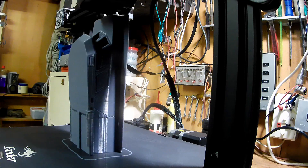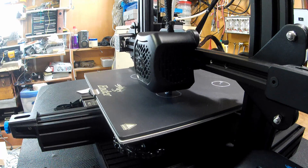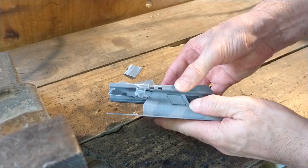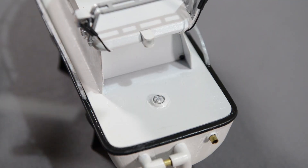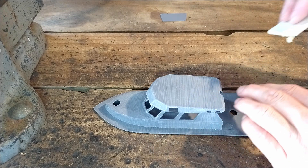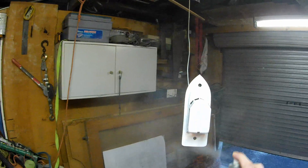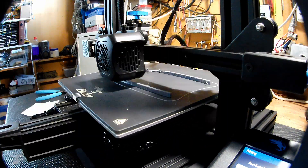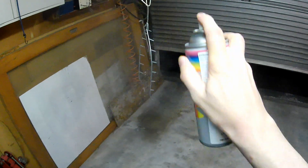It's time to start printing the upper portion of the boat. This is mostly printed in one piece; however some smaller details are printed individually such as the lights and windows. These windows are printed in clear PLA. I then start to remove the supports from the upper cabin area — there are two holes for the rear clips but I have since modified it to just have one. I sand the top, file off some excess, and notice there are some rather large lines in the top, so I apply some contact filler, sand it smooth before applying the undercoat and the main coat. I print out the railings in one piece, sand them down, give them an undercoat, and finally paint them with some silver gloss enamel, then glue them in place with CA glue.